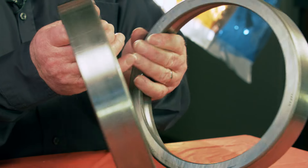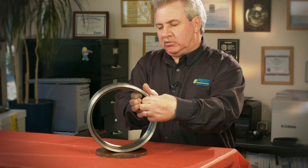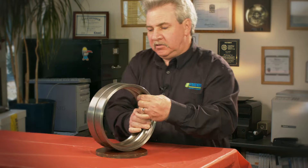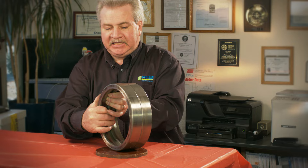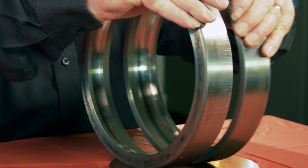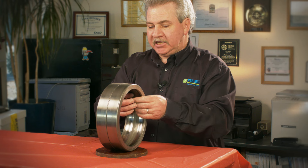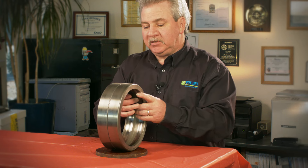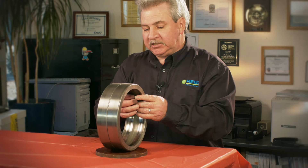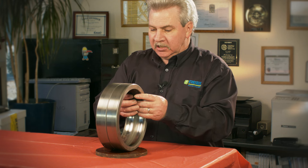Just a quick summary: we have our back-to-back configuration where the narrow sides face outward. Turning them so there's a narrow side on one end and a wide side on the other gives us tandem configuration — both bearings sharing the same load. Turning again so the two thin sections come together gives us face-to-face. Taking photos alongside the mount is probably the best scenario; if you have a snap ring at the end of the bearings on the mount, include that too. It'll save a lot of grief.